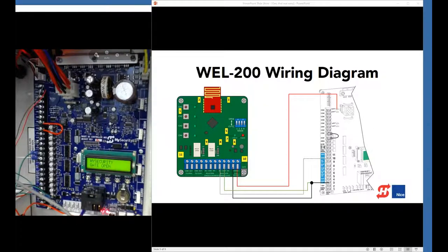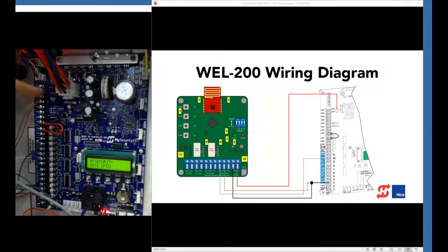First question: Can I connect to the 24-volt screw terminal next to the sensor common? That's a great question. If you look at the board, the terminal right below sensor common is plus 24 volts — you can see this on the wiring diagram. That is functionally equivalent to all the other 24-volt taps on the board: the ones at the top, and the one at the bottom. They're all part of the same circuit, and you can connect to any of those four places to power a safety sensor.